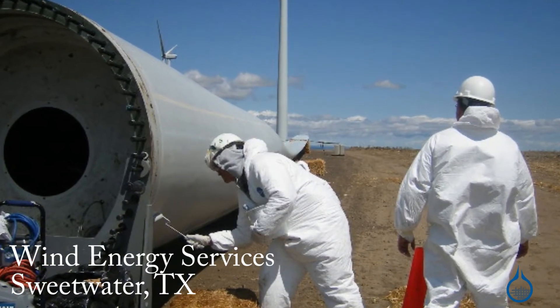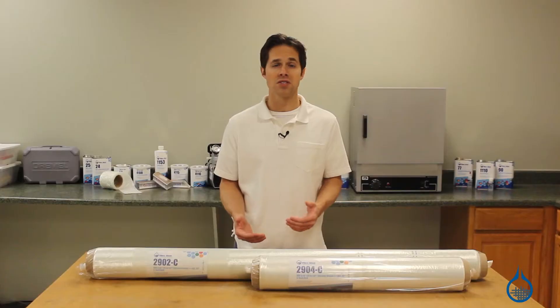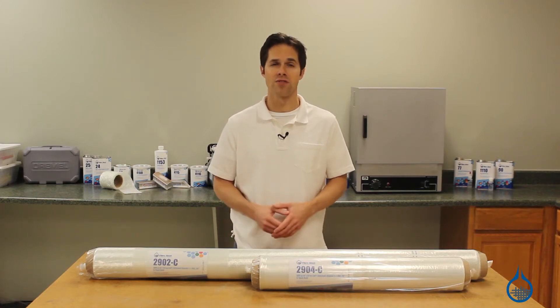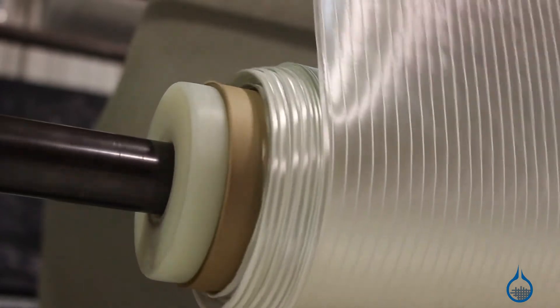Fibers are not crimped in order to maximize strength for finished parts in two directions. High strength polyester threads are used to stitch equal sized bundles of fiberglass at plus and minus 45 degrees, with stabilization fibers stitched throughout.